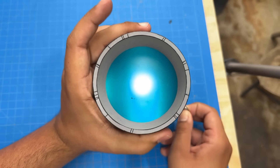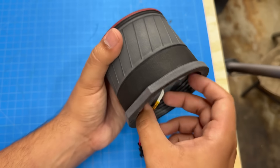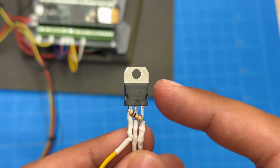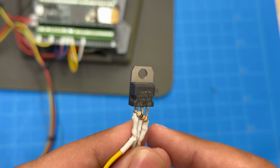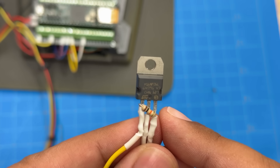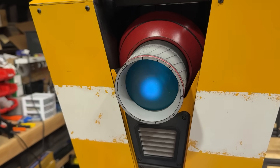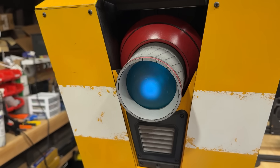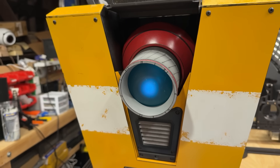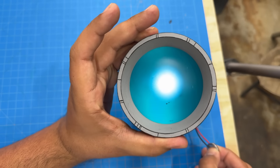I want his eye to be pretty bright, which means the LED will be drawing a lot of current — more current than the pins on my microcontroller can supply. So it's actually switched on and off via a MOSFET. This is major overkill, but I had a bunch of these MOSFETs lying around, and now when I play a voice line, his eye modulates. I'll explain more in depth when I talk about the voice hardware, but I think the effect is pretty interesting.